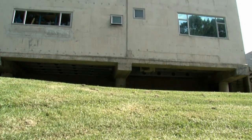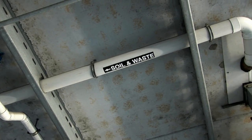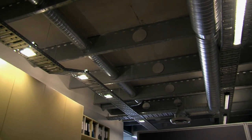We're using Speedfloor because it's environmentally responsible — it would be one of the least uses of materials for spanning on a square metre basis. One of the other benefits in an apartment situation is that with the circular voids it's very good for services — electrical, air conditioning with flexi-ducts or circular ducts — without losing ceiling space. The services are kept within the structural depth, making it an efficient use of space.